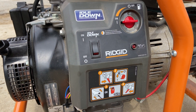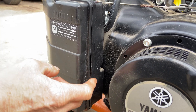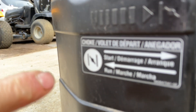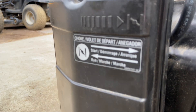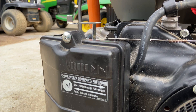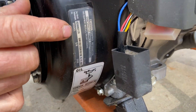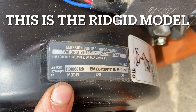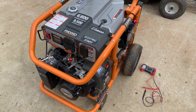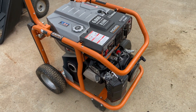The only other thing I left out: the air filter is right here. This is your air box. In dusty conditions, take this screw out and check the air filter inside. It also shows choke labels on the air box — the lever I showed you with the arrow says 'start' this way and 'run' this way. It's just as simple as going with the arrow direction after it starts up. As far as looking up any parts for this, the model number is a little tricky but it's right here. When you call up Yamaha or Rigid, you'll need that when looking up parts. That pretty much sums it up for how to operate a Rigid 8500 watt electric start generator. If you like this video, please give it a thumbs up, subscribe, tell your friends, and leave any questions or comments below.